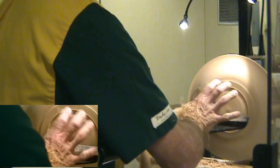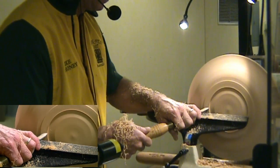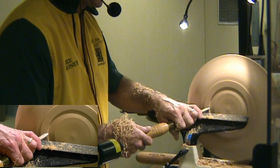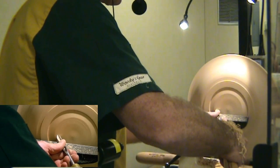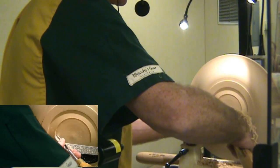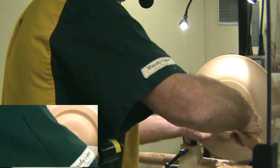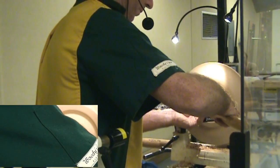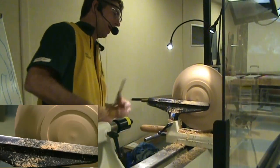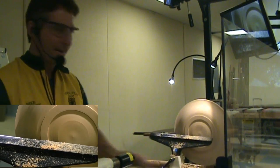I do that because I want the best hold. But if you have to scroll that chuck open, you'll mar the indent. I don't want to do that because this is going to be its final resting place. I've got a spindle gouge here and I'll cut that in — only about a sixteenth of an inch. I don't need much here to chuck at all.